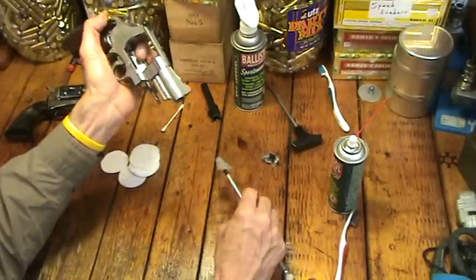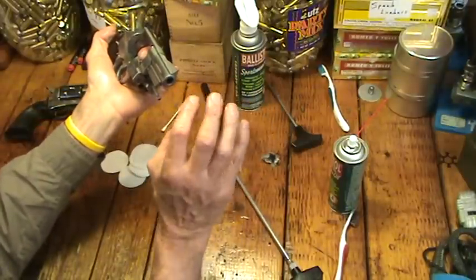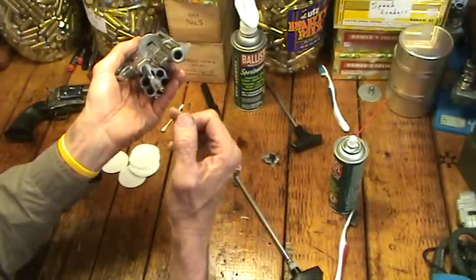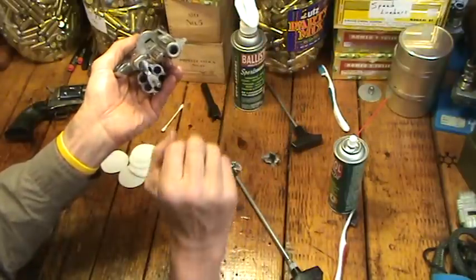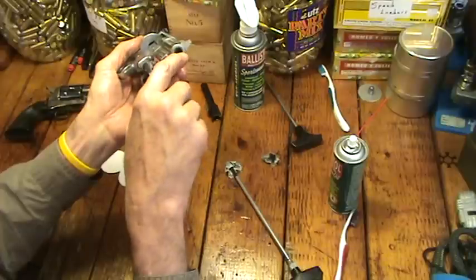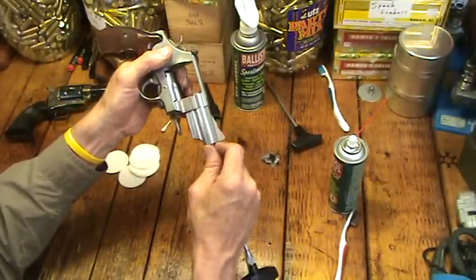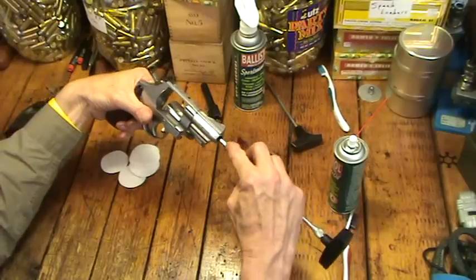I'm pretty careful — you don't want to be scratching up the muzzle. The least little scratch or ding at the muzzle can affect the accuracy of the gun. As the bullet leaves the barrel, the gases around the bullet leave at a different rate. If you have a cut on one side of the muzzle, those gases escaping need to escape evenly — if there's more of a cut or ding on one side, it can actually cause the bullet to go awry as it's leaving. You want to avoid scratching the muzzle if at all possible. That's why cleaning rods are made of soft materials generally.